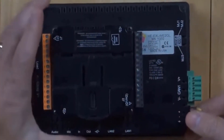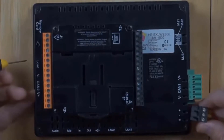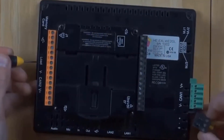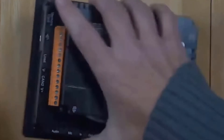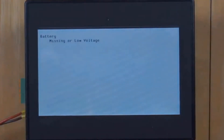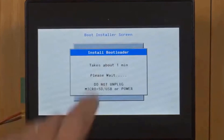If you were actually trying to recover a bricked unit, you wouldn't have seen it boot. In my case, I have a unit that doesn't actually need to be recovered — it isn't bricked, it works perfectly fine. So let's try this again. I'll get my right hand ready, press the button with the screwdriver, and apply power to the unit. I'll flip this over, watch the boot process, and see if I was successful. I was successful this time. I pushed the button while powering up and let go after applying power. We have effectively booted from microSD.